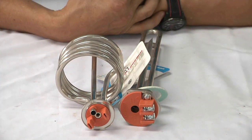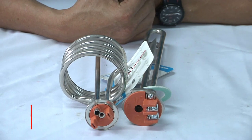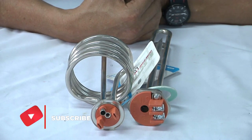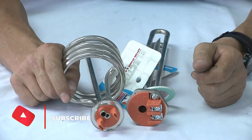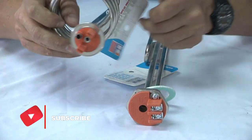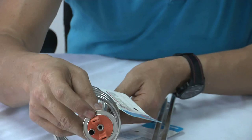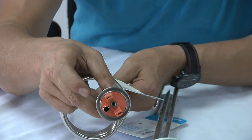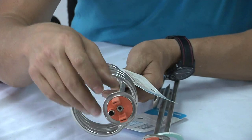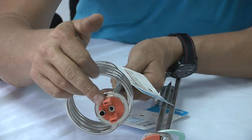I'm going to run down quickly what elements you need to use on a 100 litre, a 150, and a 200 litre geyser. For the 100 litre geyser you would use a two kilowatt element, that means 2,000 watts. This element will have one spiral less and will be red instead of orange. A 100 litre geyser uses a red color element which is two kilowatt.